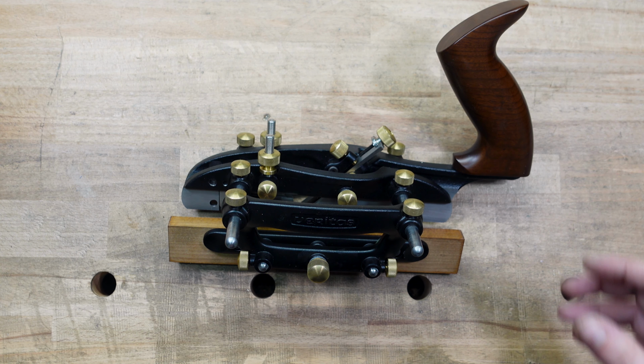But this is what I'm going to use. So what I do is I just have one of these. This is actually like a sponge for a car for waxing. I just use one of those, rub it onto the rods. There you go. Then what I do is I take the clean side because I don't want it too caked up that it's going to jam things, because sometimes with Johnson's, it can be in clumps. Like you can actually get, see how it just clumped up like that. That can happen and it can jam into those rods and create some issues and just look nasty. So just clean them off a little bit. You don't need to put a lot on there.